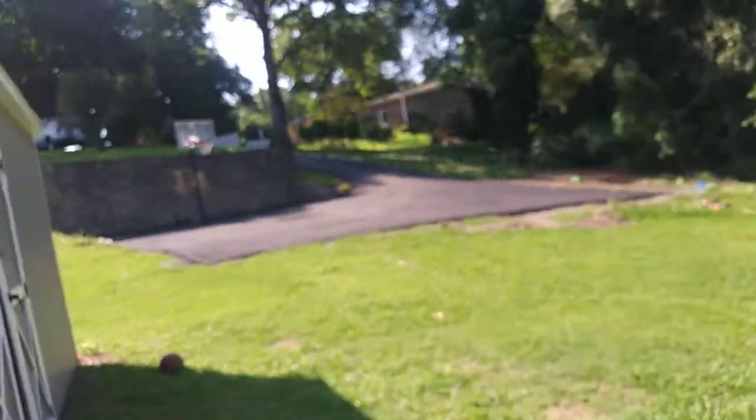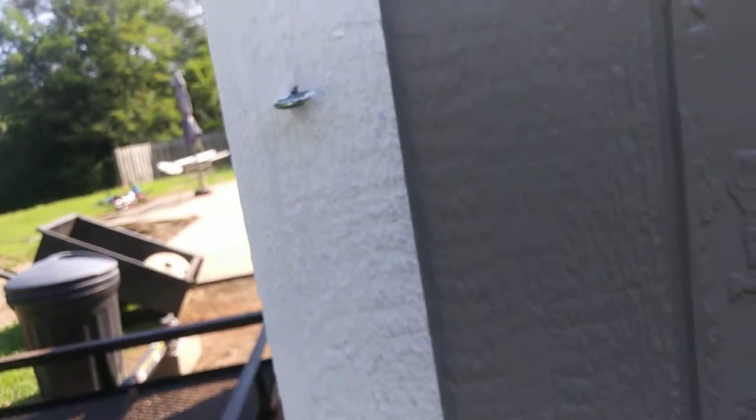And like I said, you don't have to use a big brush. If you want to run the trim, a 2-inch sash brush would be a way to go. But it's easy to ride the line once the paint is in the brush. I mean, you have to come way over here, and that's kind of stupid. You just stay right here.